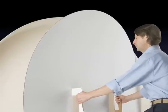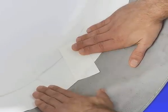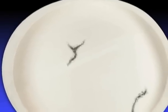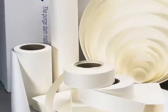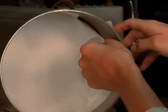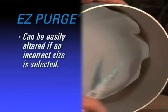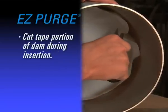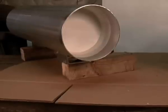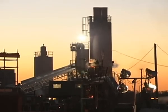In just minutes, EZ Purge is ready to go. If you need to reposition EZ Purge, carefully remove the tape portion of the dam from the sidewall of the pipe, move to the desired location, and apply additional AquaSol water-soluble tape for reinforcement if required. If the water-soluble EZ Purge dam tears accidentally during installation, simply cover the torn spot with AquaSol water-soluble tape. Water-soluble tape is included in a repair kit with all EZ Purge sizes greater than 56 inches. Should an incorrect size be selected, simply cut the tape portion of the dam as it is being inserted and overlap the cut ends to create the desired size. EZ Purge has quickly become the industry standard, specified by many major engineering and construction companies in the petrochemical and nuclear industries.